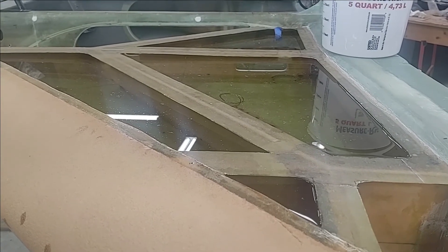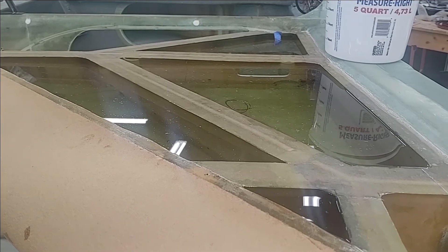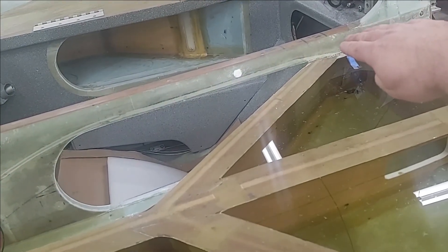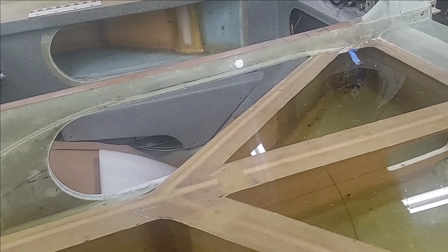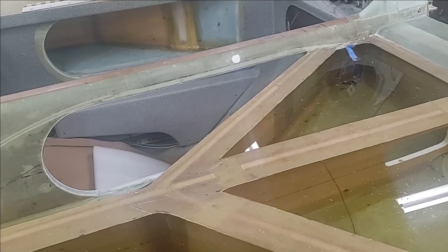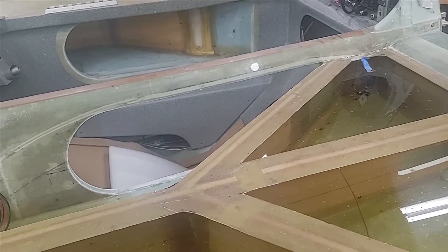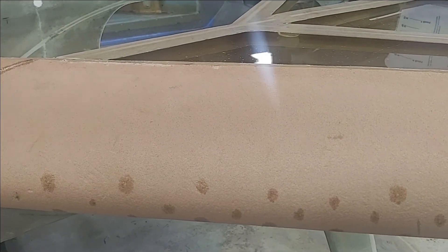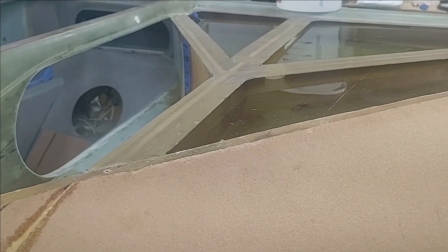I'm pretty happy about that. Instead of only getting about 24 gallons — losing some fuel from the elbow room mod, which from this angle you can see creates quite a severe angle going back — I was able to reclaim that fuel. I'm also fairly certain that having a wet leading edge gave me maybe close to a gallon as well. So I do expect to have about 27 gallons per side, maybe a hair over, which gives me about 54 total gallons if I go full fuel. Thanks for watching — cheers!